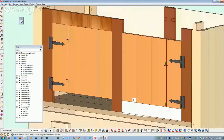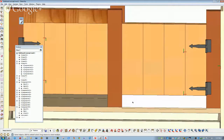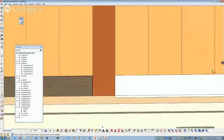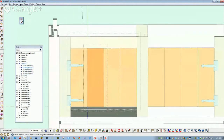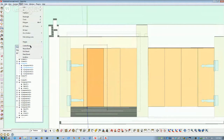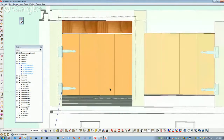And you can see that my filler panel on this side is not quite the right size. So I'm thinking the easiest thing to do is make all of my boards a 1/4 inch shorter. Well, let's verify that. Dimension function here, point, 1/4 inch. Yes. I will make this active, and now I'm going to go into that same plug-in. You can also resize board sometimes. I will make it 14 inches even. Now you can see that all of them got shorter everywhere.